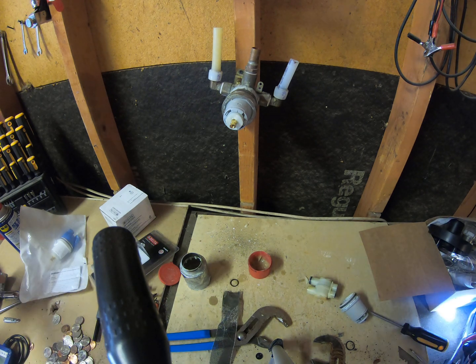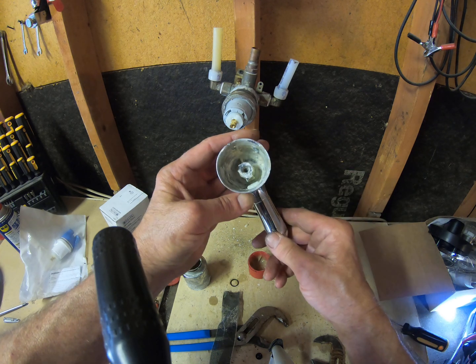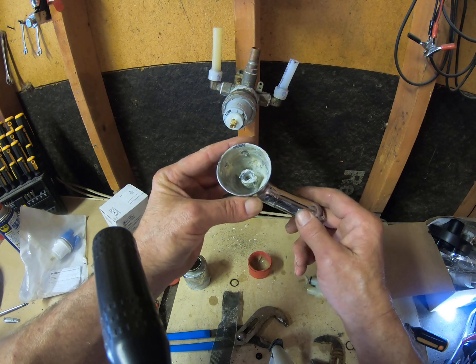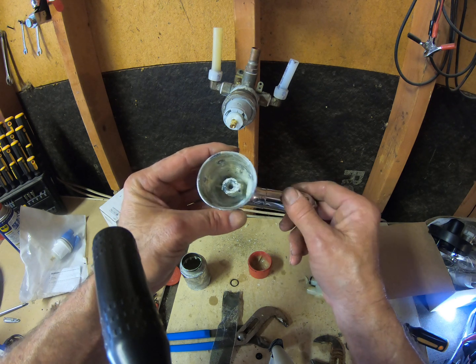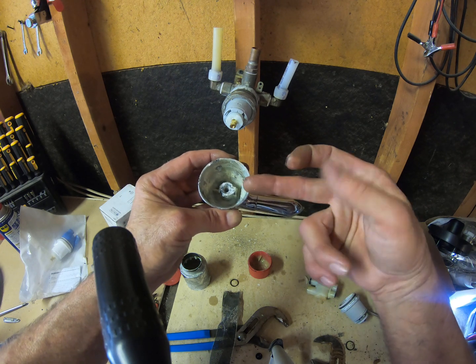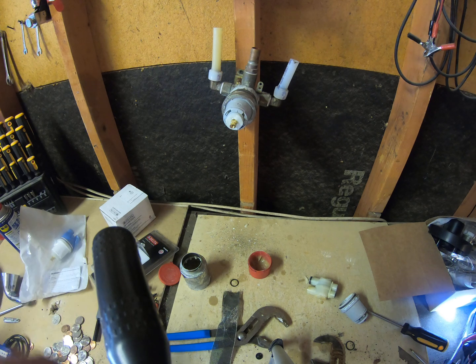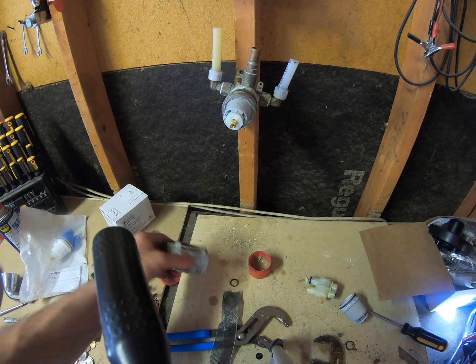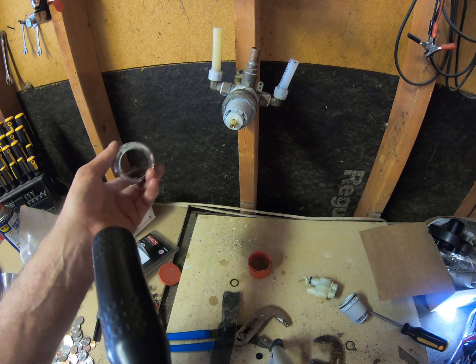Alright, I seen one video, the guy was asking what size the Allen wrench is on these. Honestly, it seems to me like every handle has a different size. They don't, but the new handles have a different size wrench than the old ones do. The Allen goes in here, rotates 2 turns out this way, the handle should slide off. So, we don't have that today. I couldn't get a new metal handle, so I'm going to show you the same thing, the plastic one.